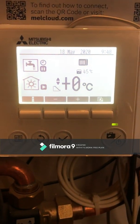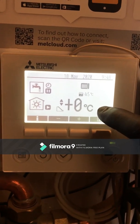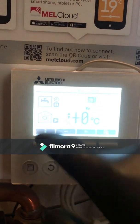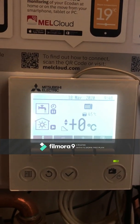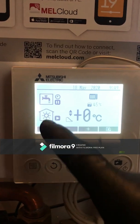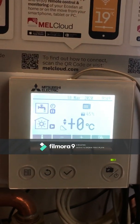From the front screen we can see all of the icons. The icon there shows that the compressor fan outside is running — if I went and stood outside I would expect to get a blast of cold air. The current temperature of the tank is shown, along with the fiddle factor being applied to the weather compensation curve, as covered in a previous video. The pause button on the hot water side shows hot water isn't currently running, though the timer icon is active. The heating is currently running, shown by the play symbol. The absence of other icons underneath the heating symbol means the system has been plumbed as a single zone heating system, relying on the underfloor heating actuators upstairs and downstairs to control the flow of water through the underfloor circuits.